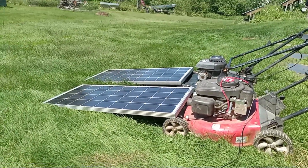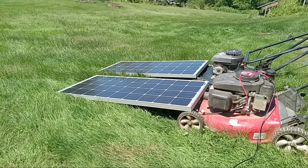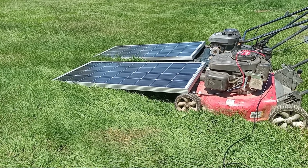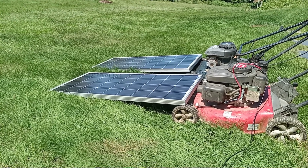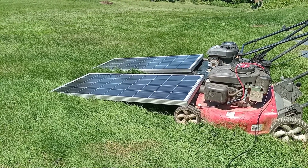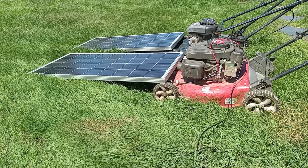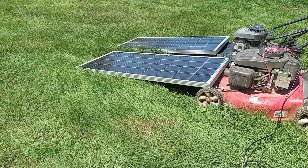If you can see there, I've got two 100-watt panels laying at a really bad angle. If I dropped them, we'd probably be getting about 180 watts into the unit if I laid them flat, because the sun is tracking off to our left there and it's almost directly overhead. So if I laid the panels flat, we'd have a better angle. I'm using two lawnmowers I pulled out of the dump that I'm working on repairing, and I thought I'd use those for solar stands.